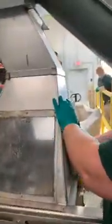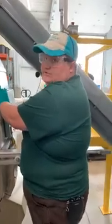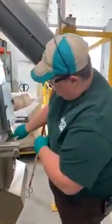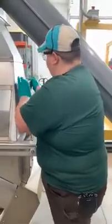So if you look in here, you can kind of see it through there. We have our grind starting to pull in, and as the material comes in, it is going to be pushed up into Hanna. It's a little hard to see, but there are those things moving in a circle. Here, I can get you guys a good look. So all of our doors on Hanna have a security catch on them, because this machine is actually pretty dangerous. So anytime we take anything off of any of these contact points, she'll actually stop so that none of our team can get hurt. So that's what she looks like inside. You can see the auger and the grinder. They're going to pull up all the material into Hanna. And then once I put this back on, she starts back up again.